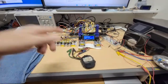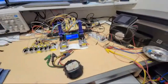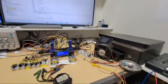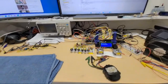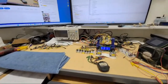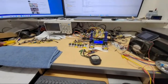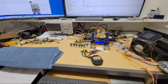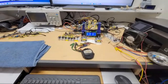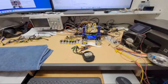For this kind of control stuff, I haven't needed to do that. I kind of at first tried to do that on the first little processor I built, on these small boards, the smaller chip. I was trying to do all sorts of stuff where, if it was a bigger error, it would correct faster and stuff. But I wound up really making it way more simple. And I might walk out there and show you the unit that's running outside, but it's been fine. For the EXVs, I just have a decent sweet spot to first open it to, and it gets it in the ballpark, and then it starts adjusting.